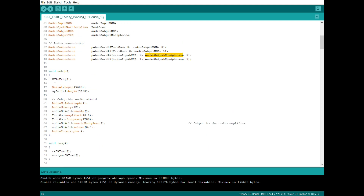The only other thing to do within the setup function is the following few lines: disable the interrupts for the shield; AudioMemory 12, which is quite a common value for that; enable the shield; enable that test oscillator and set its amplitude to 0.1 — if I could go lower I would, but the options are between 0 and 1.0, so 0.1 is the smallest increment. Test oscillator frequency: 700Hz. And then for the headphones, just unmuting those, setting the volume for the headphone at 0.8, and then re-enabling interrupts. And that's it.